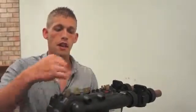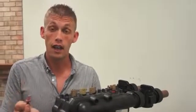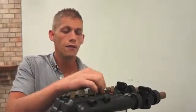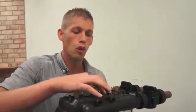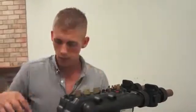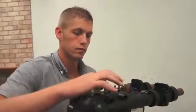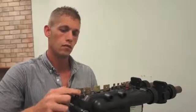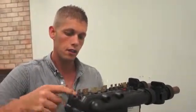The imprint is where it seals on the right-hand side of the valve. It should be a very even, very pronounced impression. If there's ever an odd-looking line, or a scar where you can tell that something was stuck in there, it's an indication to look in the valve and try to remove whatever debris was causing the problem. You can also lubricate these if they seem dry.